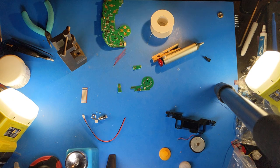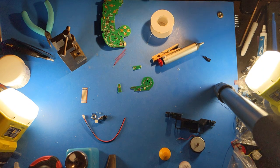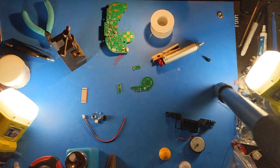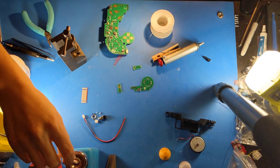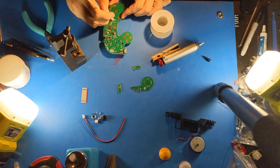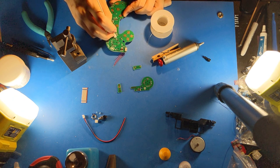If you do choose to use a solder that uses normal flux, oh, one of my lights went. Hmm. Then you'll have to clean it, or else the controller just might not work or work unreliably. That's because normal flux, I call it yes clean flux, leaves a conductive residue, and the residue can interfere in the performance of the controller.